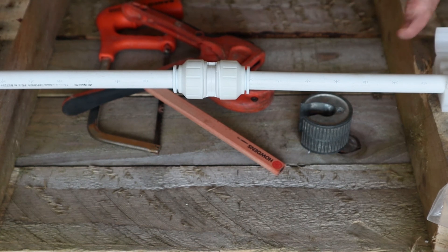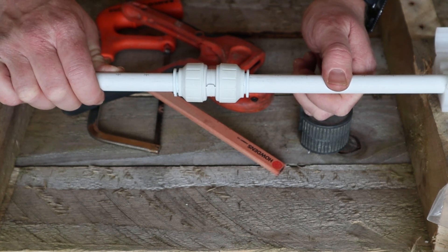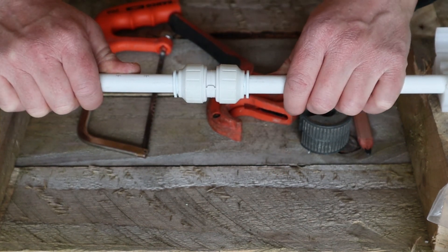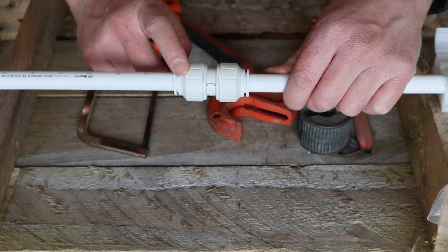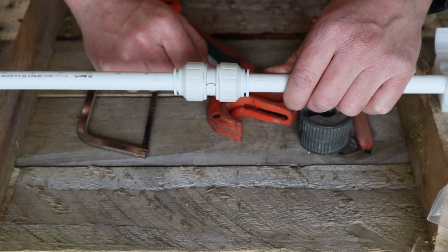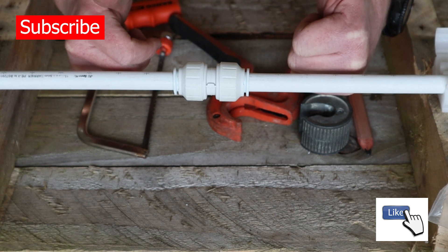And that is it — your push fit fitting complete. Plastic pipe fitting onto plastic pipe and onto copper. Hopefully this video has been helpful if you were worried about using one. It can be a bit too bulky to fit in tight situations, so a different kind of fitting might be better in some cases. But don't worry — a lot of people say don't use a plastic fitting, you need a solder fitting, but I find these more reliable than a compression fitting any day of the week. They're a brilliant fitting and they've been out a while now — tried and tested. If you've liked the video, please subscribe, and if you liked it that much, give us a like. Thanks for watching and I'll see you soon.